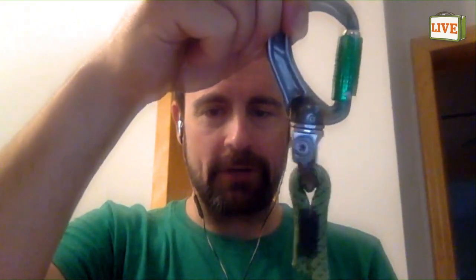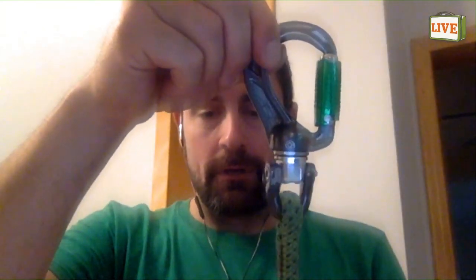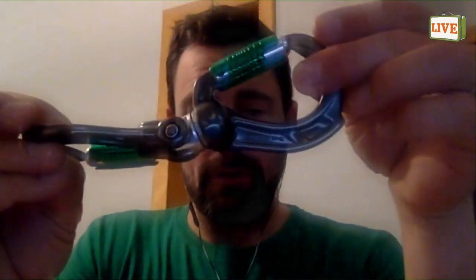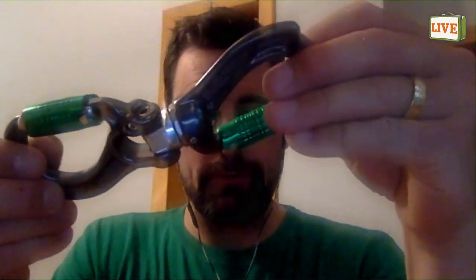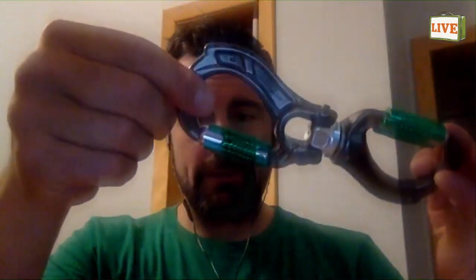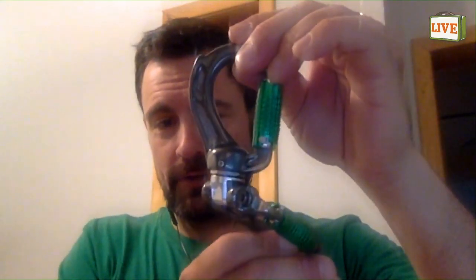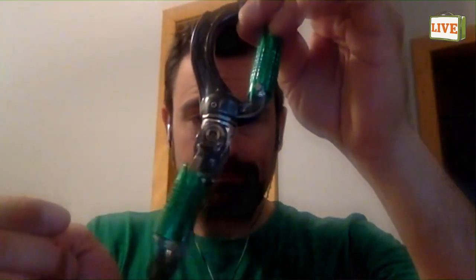There's a bow shackle — the wide one — and also the D shackle. I've got it installed onto the end of my lanyard sewn connection, so now I've got a nice tight compact swiveling connector on the end of my lanyard. You can add a boss and yoke together to make a swiveling connector — great in a rescue scenario, perhaps to attach yourself to the victim.